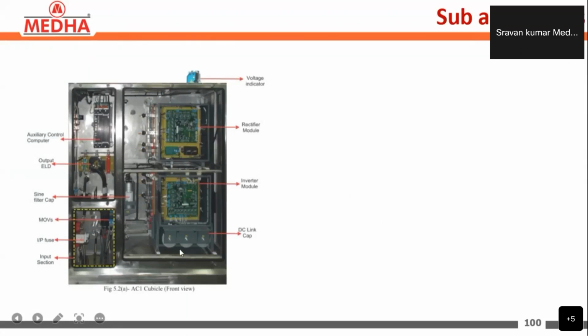So here we can see the sub-assemblies. This is the input section. We have the input fuse along with the micro switch. If there is any damage in the fuse, it will indicate to the control circuits. Next we have the MOVs, metal oxide varistors, to suppress input variations and input voltage spikes.